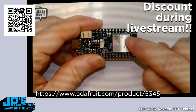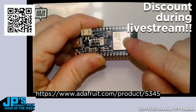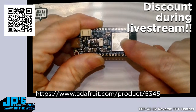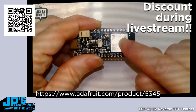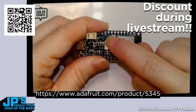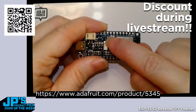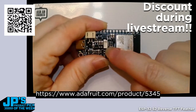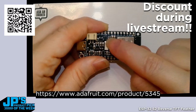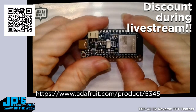ESP32-S2 module. This mini module has 4 megabytes of flash, 2 megabytes of PSRAM. It's great for Arduino, CircuitPython use. That PSRAM makes it excellent for IoT projects because you can buffer your gigantic JSON data. Like I mentioned, there's a MAX17048 battery monitor. It's ultra low power, but you just get really good battery monitoring on it. It'll tell you the percentage and voltage of your LiPo battery when in use.